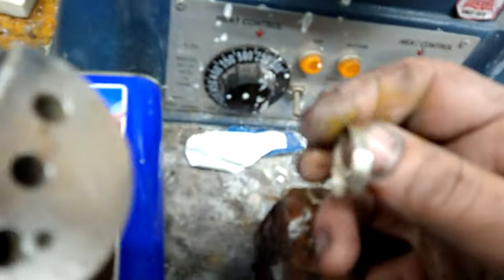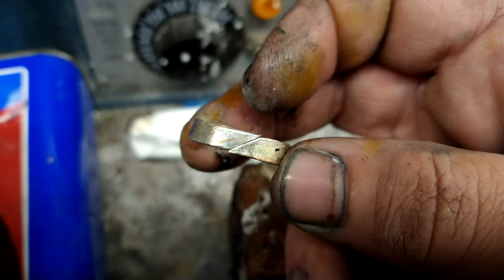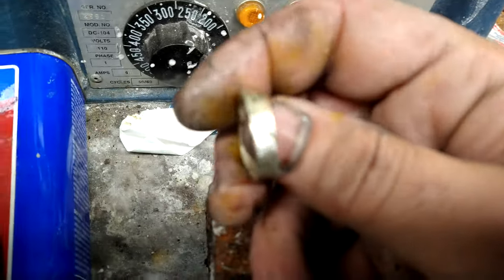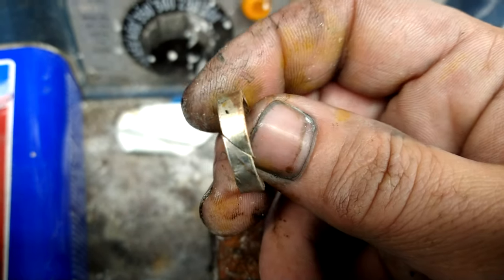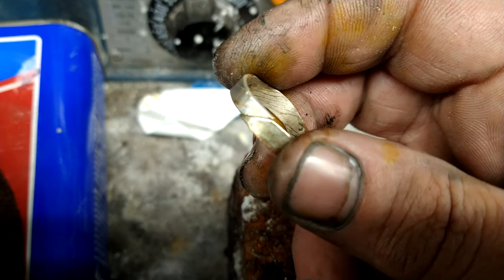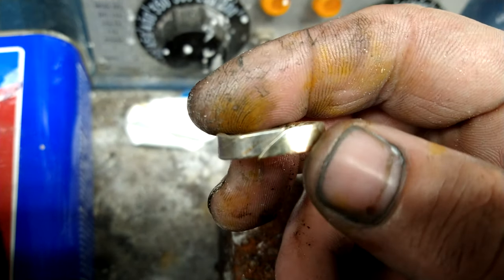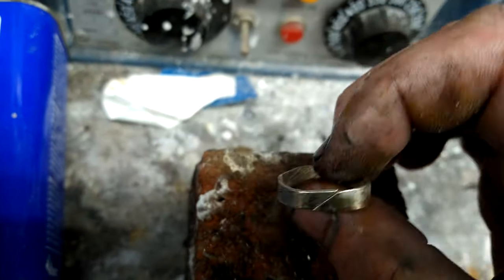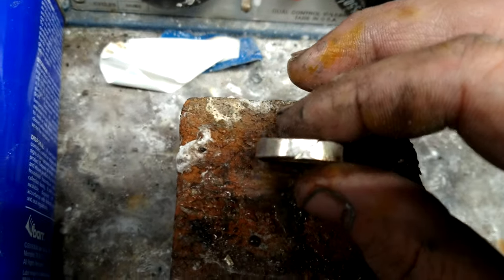You have to drill a billet open. Now, I'm not opposed to doing that. They're actually kind of fun, but it's prohibitively expensive with gold. It's not that you're going to waste the material, because you'll get it back, but you have to purchase and start with a lot more material, because a lot of it gets cut off. So this is an unconventional medium. If you're not going to go that route and you're going to solder it shut, you must have an unconventional approach.